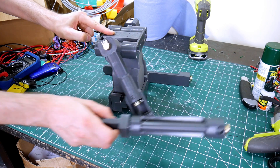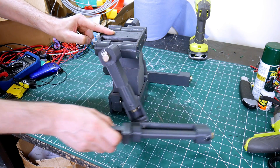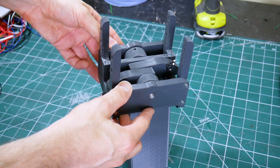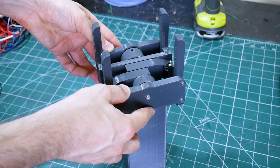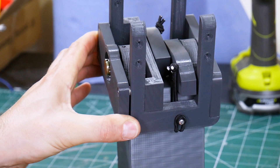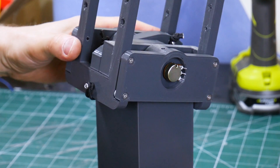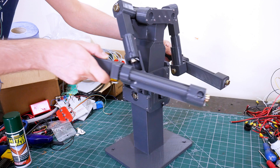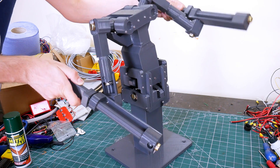That covers all of the arm motions for those three arm axes, and we've also got a stick to rotate the wrist when I've built that into the robot - that seems like a really good range of motion. The robot can lean left and right and backwards and forwards around its abs and ribs, but we need a mechanism in the puppet that self-centers. I've built this mechanism - it's a bit like the robot arm self-centering mechanism with sprung fingers, which supports both axes so they both spring to the middle. That allows me to lean the robot by pulling the arms around, and for now that gives me the complete range of motion we have in the physical big-scale robot.